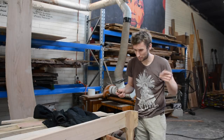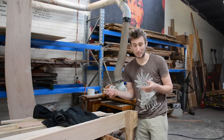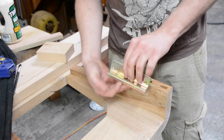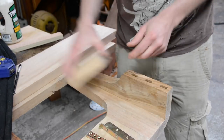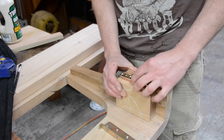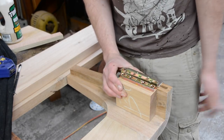While that dries, we've got to do one minor alteration to this leg assembly because I wasn't able to locate a style of bed bracket that was going to work with this style of base. This is the style of bed bracket we have to use — not to worry, because all it means is I glue in a block like this which is flush mount. It gives us a little bit of extra support for this mitered piece, that piece gets screwed on there, this piece gets screwed on the rail, and we just continue on like it never happened.